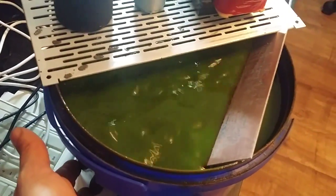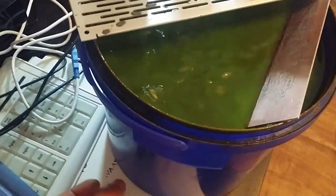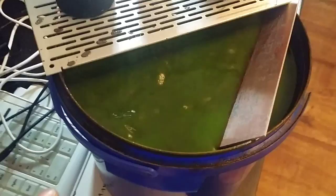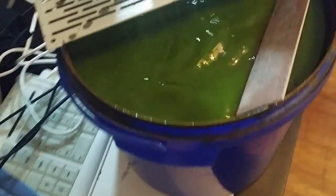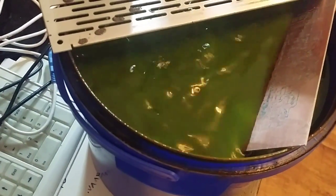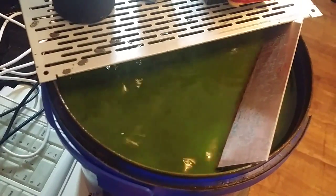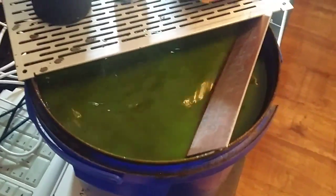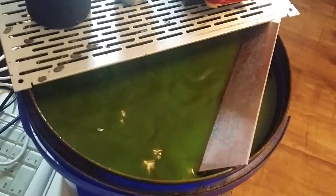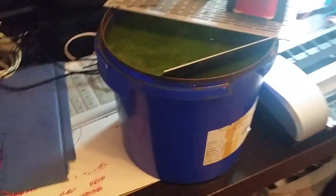I'll leave this for about a day to settle, then I pour everything into another bucket and leave a bit at the end where all the copper concentrate has settled, then chuck that away and add a bit more acid and water. I do this about once every month if I'm using it a lot, or once every two or three months otherwise, to remove the copper concentrate from the bottom — the more copper in your solution, the less the acid reacts to new copper.